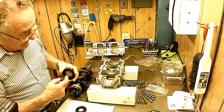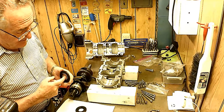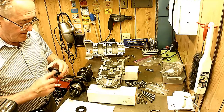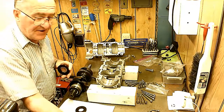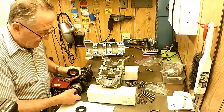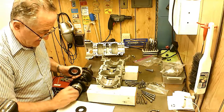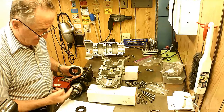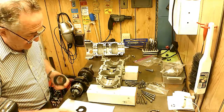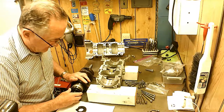I'm going to take a little bit of white grease and in this lip seal here, I'm going to put some of that grease around in there, kind of pack that with grease. Grease is a very good lubricant for rubber — it works a little better than oil. Maybe smear a little bit on here too. I'm going to put that on there like so.